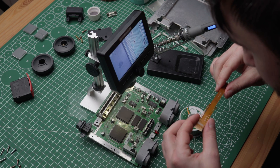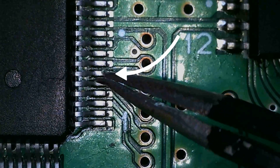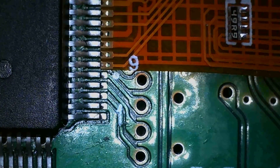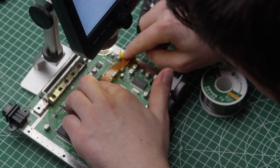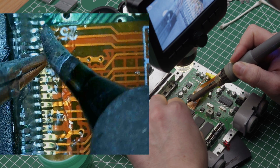Now comes the crucial part: soldering the ribbon cable. If you attempt this, please focus and always double-check before you go in, as with any other micro soldering operation. We need to align the ribbon cable with pin number six of the RCP chip, which is the one counted up from the bottom right. The ribbon cable is really fragile and doesn't hold much resistance against long streaks of heat, so be delicate and quick and use plenty of flux. I use a small strip of Kapton tape to secure the cable in place so it doesn't move during soldering.